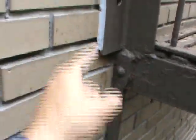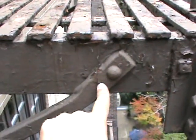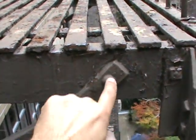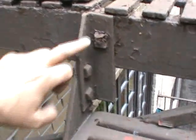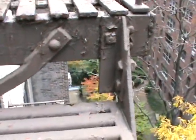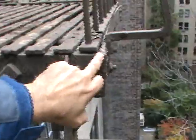Try to seal anything that water can get in the back. Same thing here. Verify this, leave it primed and sealed for me. Or if it's in good order and there's no rust inside, we could pop another bolt back here and basically keep that one. It's like putting suspenders on a belt. As soon as you get this happening, that's got to get changed out. Any original hardware can stay if we're going to be verifying and load testing. All these connections clean.